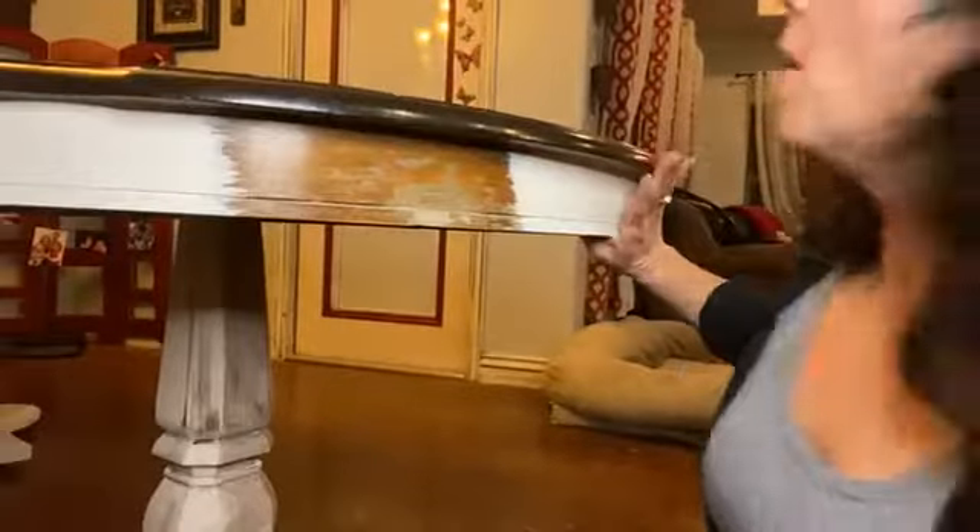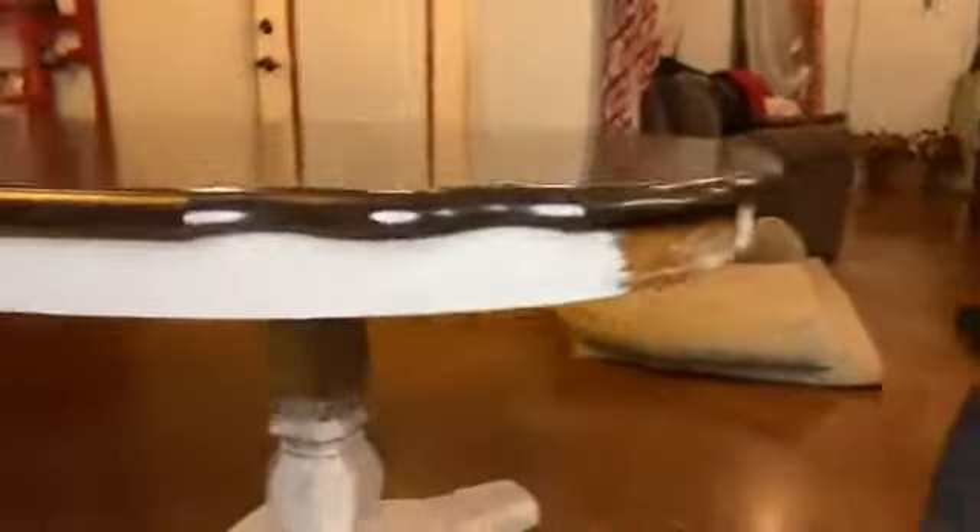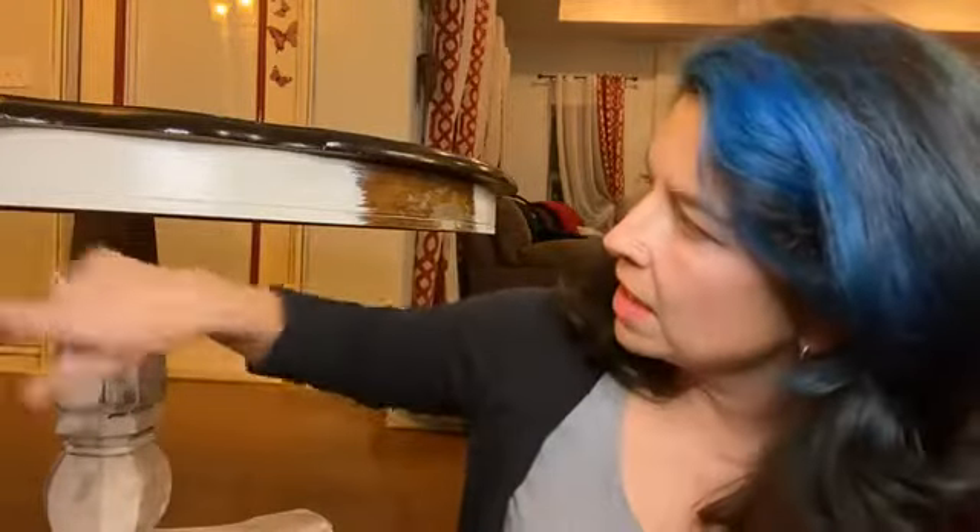There is the almost-finished table. I'm going to Gator Hide the top — you want to see the top? I put another coat on it. It did take three coats, but check that out — three coats and it's done. I didn't sand it, I just cleaned it and then put three coats of No Pain gel stain in espresso. I'm going to Gator Hide it off camera in case I mess up, but I'll do a video on it and post it in speed-up motion so you can see how I apply it. I'll clear coat everything and use a satin on the side and the table base, but I'll do Gator Hide on the top for durability.